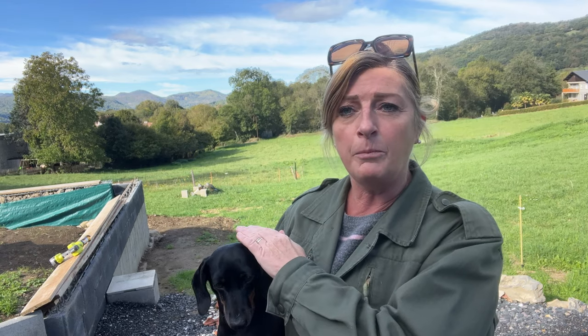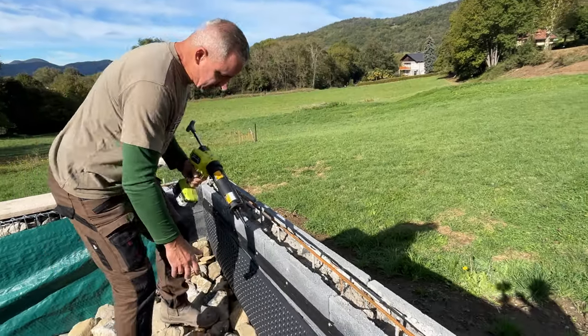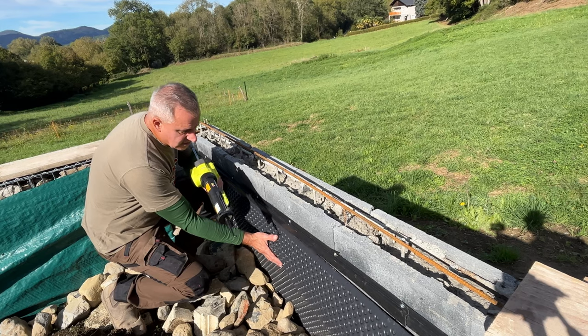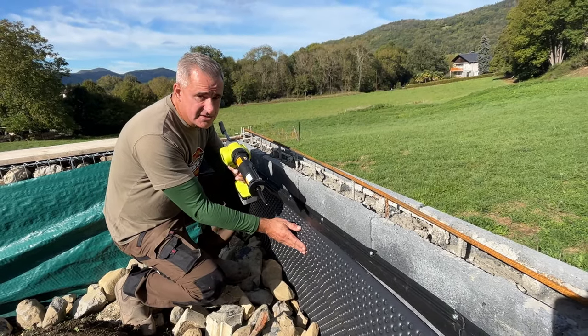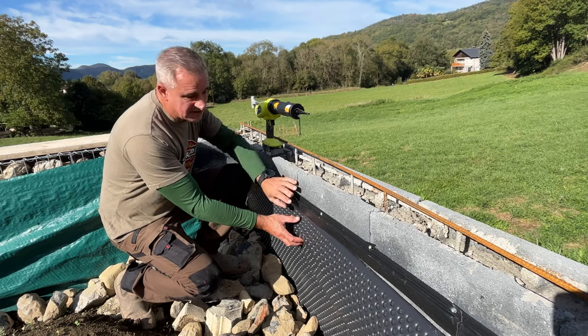At last we're back up here — we've had a few days not being able to work outside because of bad weather. Today the main priority is to get the forming boards along the top of this retaining wall ready and prepared so that we can start filling the top in with concrete. First things first, I've just got to put this membrane back up — with the sun and everything else this has basically expanded a bit so I need to get this back up underneath. We've been lazy but the weather's been awful, so we've not been able to backfill with soil. I'm going to put up extra sealant to glue this and then we need to get that soil over.